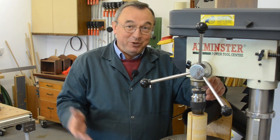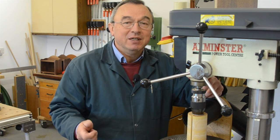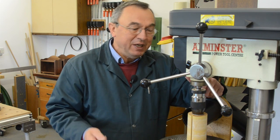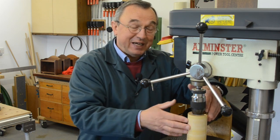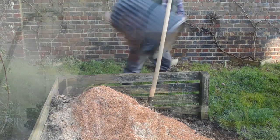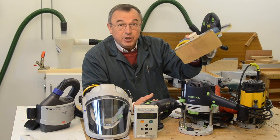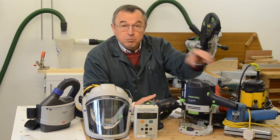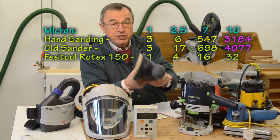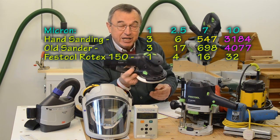Someone said to me that the worst thing you can do in your workshop is sanding. Well, maybe it is — but if you're using a sanding machine connected to a properly serviced vacuum, then it's not the worst thing you can do. I found that hand sanding is far worse than sanding with a really good quality machine. Sanding with something like this homemade drum sander here could be pretty fraught. If you use an old-fashioned sander which has no means of capturing the dust as it's created, you're going to get some pretty bad levels. But if you use a modern sander designed to pick up dust efficiently, and use it in combination with a really good quality extractor, then the dust levels in your workshop will barely change when you're sanding — and I mean that, I've measured it.